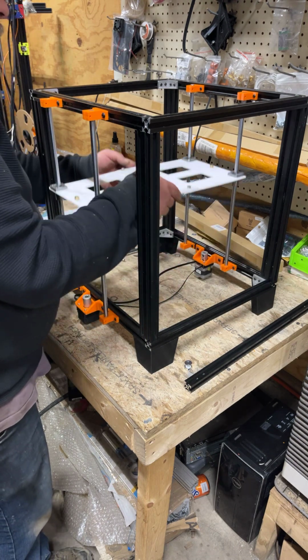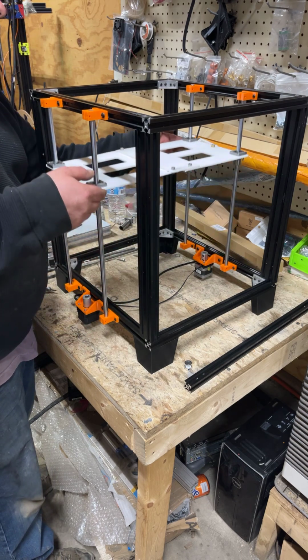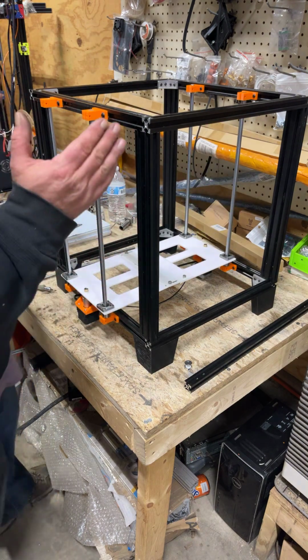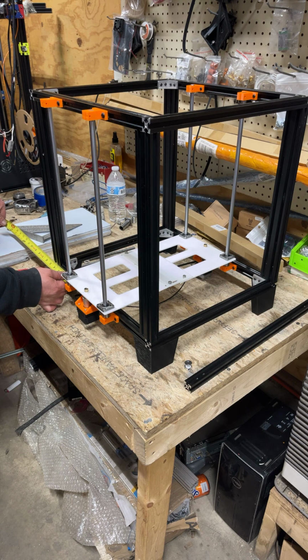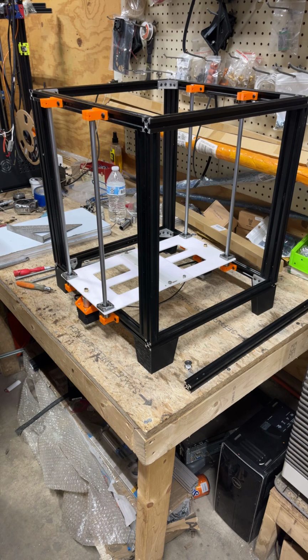With no lube, you will probably feel a little bit of a bounce, but you just want to make sure after you've leveled them that they're not pinching in on these. And another thing I like to do is, from the outside of the printer to the outside of this bracket, check the top and bottom to see if the measurement is the same or very, very close.